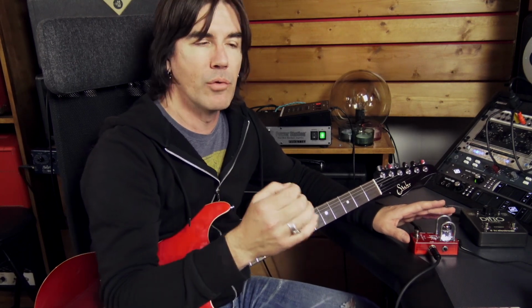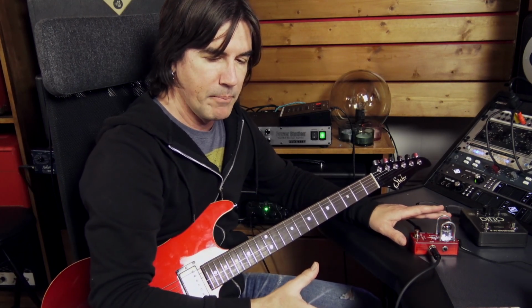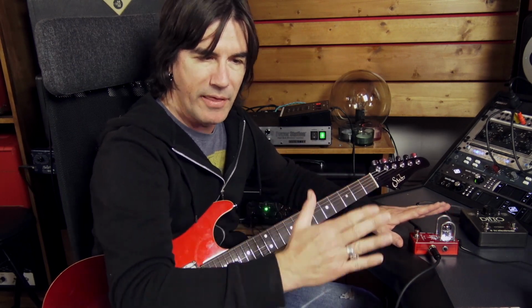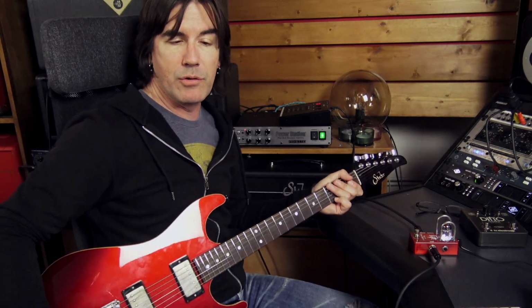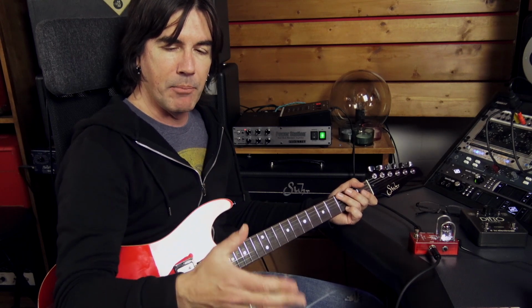And it's always a good rule of thumb to put a buffer at the point in your chain where it basically sounds good to you, and then if you keep adding pedals or cables beyond that point, it starts getting dull beyond what you like. So if that makes sense. So if that means 15 feet of cable or 20 feet of cable, like, you might use a 15 or 20 foot cable to your guitar pedal board and then maybe have like a couple pedals, and that sounds good to you. But anything beyond that, adding some more pedals seems to degrade the tone. That's the point where you want to add the buffer in your signal, essentially.